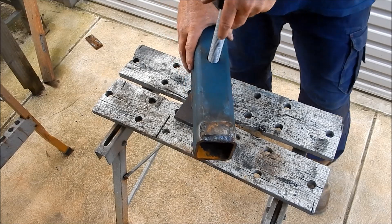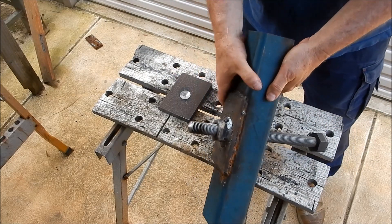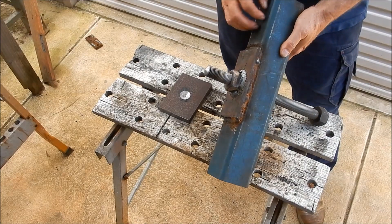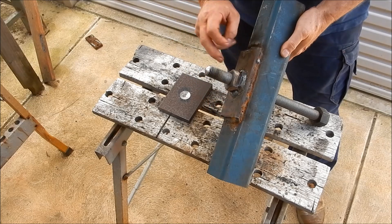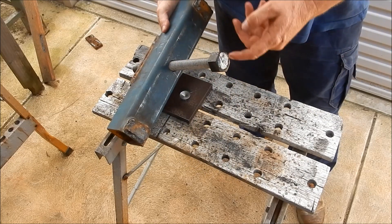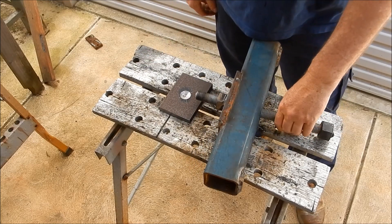Fairly simple concept — nothing great in it. I've welded a compensating plate onto this 75x75 SHS with 6mm wall thickness, so it's pretty thick stuff. I put the compensating plate on just to increase that bearing load that is transferred through that nut. The top nut here is welded in place — this is M24 galvanized high tensile threaded bar.